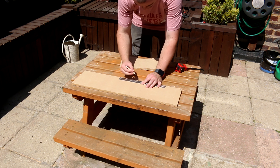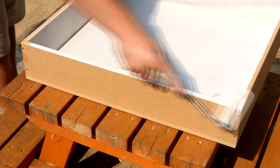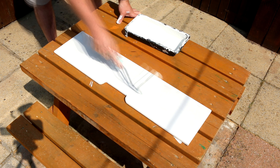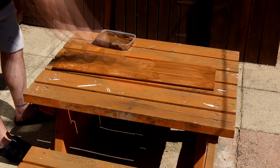Next up it's time for paint — my least favourite part, especially when it comes to painting MDF. Getting a nice finish on the exposed edge can be a right pain. What I'd recommend: steer clear of any type of MDF sealer — waste of money. Just use an eggshell wood paint instead; eggshell paint really is great on MDF. I applied one coat with a foam roller, let it dry fully, gave it a light sanding by hand, then applied a second coat. You can go with any colour you like. For the drawer fronts I followed the theme from the Gruffalo beds I'm making at the moment, but you could use a finish to match your own decor.